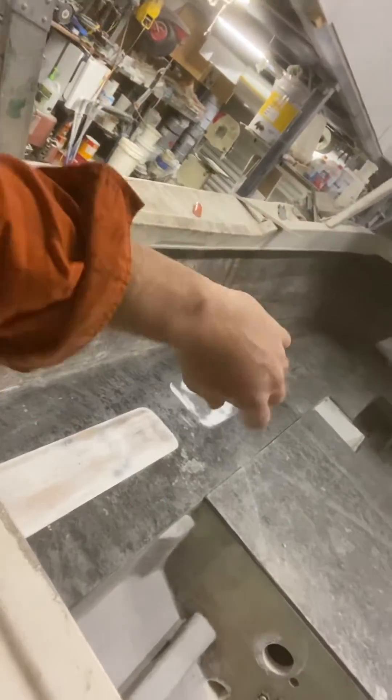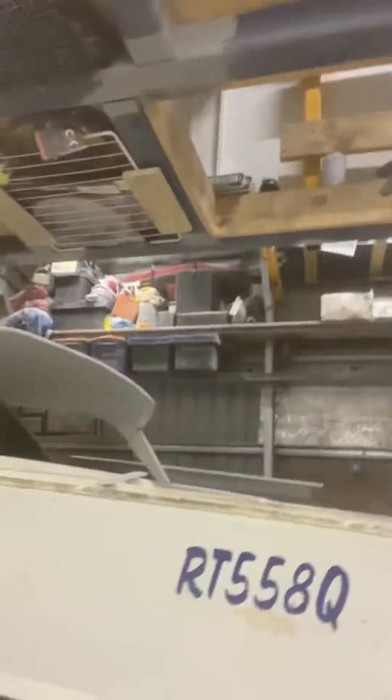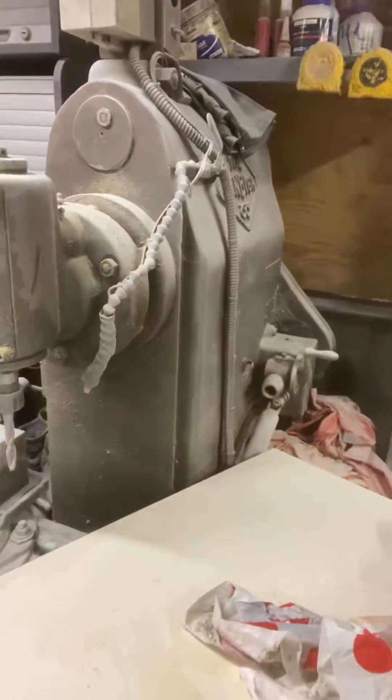I've had nothing but bad experiences with polyester resin and vinyl ester resin. Anyway, this is where I'm at — the floor is all epoxied and glassed with epoxy underneath and that's fine. I've never had any problems with polyester or vinyl ester doing sheets; I always make it a little bit hot. But I've had problems making the bog, and this bog is still squashy after an hour. I'm glad I didn't put it on — the heat's gone out of it now, it's normal.